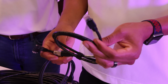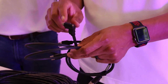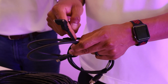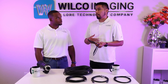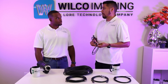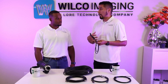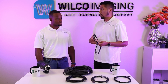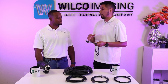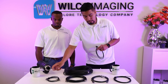So you did mention that the USB 3 is one of the common cables? Yes, it is one of the common cables. The key benefit of having a GigE camera is that you'll be able to run more industrial-grade cameras that are either 5 GigE or, with the newer ones coming out, 10 GigE. They'll be able to power on and not have any bandwidth issues or dropped frames, because your cable's going to be very strong and robust for that.